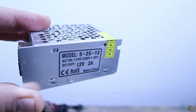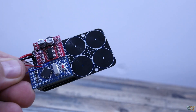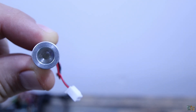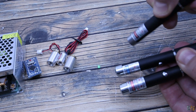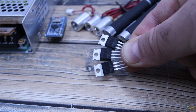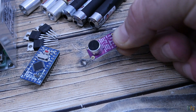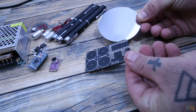For the power supply we can use any 12V supply we have around with a decent current amount, something around 2 amps or more. As a driver I want to use as always the Arduino. For the lasers I've just ordered a red, a green and a blue laser diode. These are already inside of a metal case so they are quite easy to keep cool. This will cost you from $3 to $6. The cheaper option is to just buy a laser pointer like these ones, which already have the current limiting circuit and all we have to do is turn them on and off using a MOSFET. For the audio control all we need is the Arduino together with the microphone module, which will analyze the sound and get real values, and according to that we can make our movement of the mirror.